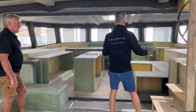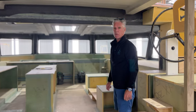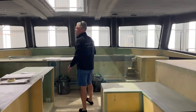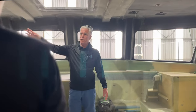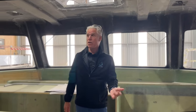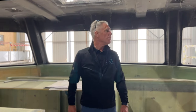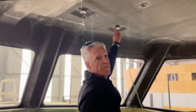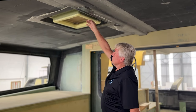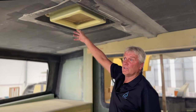When the Versa helm is down, we've sustained and maintained perfect visibility for piloting the boat in foul weather, which has always been a really important part of the Versa helm. As you walk into the main saloon, you see that all the support beams and the roof of this coach roof are all carbon — it adds stiffness, which is important because this boat will have an overlapping Genoa that attaches to the top of the coach roof. There are also flush mount hatches that will be flushed with the deck and drained down to drop-ups, since you've got to drain these hatches as water gets in them.